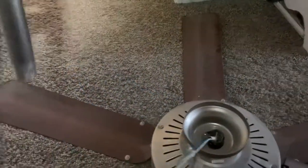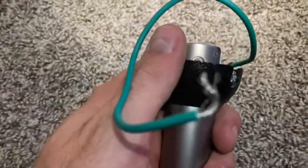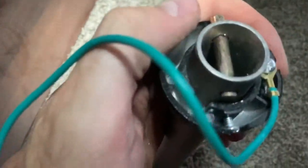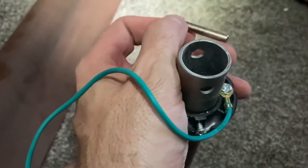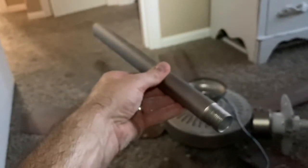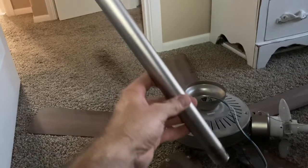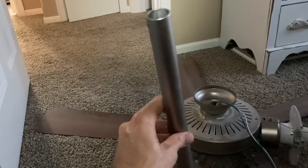I'm going to take the down rod off and separate that here and unscrew this little half-ball thing that hooked up into that bracket earlier. We're going to remove the little pin from inside because my goal here is I want the down rod exposed like this. At this point you can either replace the down rod and put everything back together, or you can actually take your hacksaw and cut it down to size. Check the manufacturer's recommended lengths — they'll sell specific down rods: six inch, three and a half inch, 12 inch, 18 inch or whatnot. Do not cut the threaded end. Instead cut this end up here — you can see that bare end has two holes in it that the little pin slid through. You'll have to cut it down to size and then you can actually drill two new holes fresh.